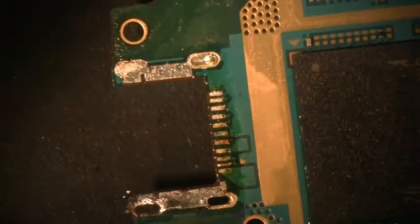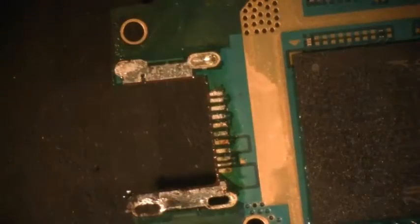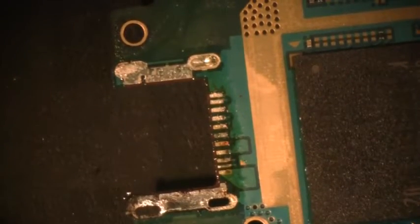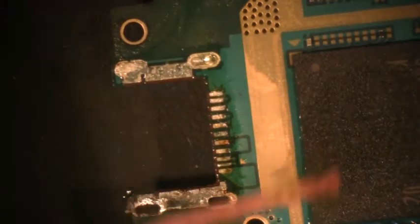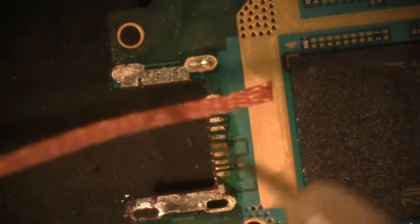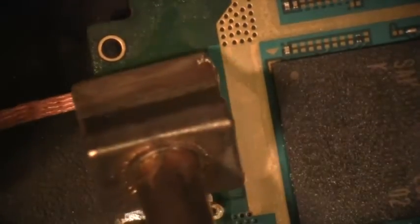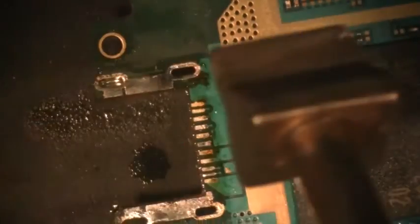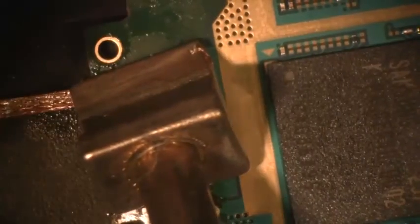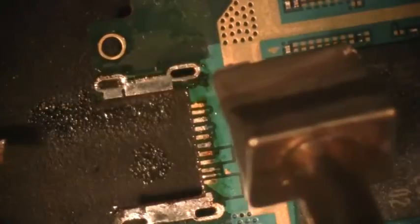So far, I've not caused any damage whatsoever. I want to clip off that little piece of silver right here. I'll reapply a little bit of flux to my solder wick, just like that. Come down here, hold it right up against it. Got one done. Got two done.